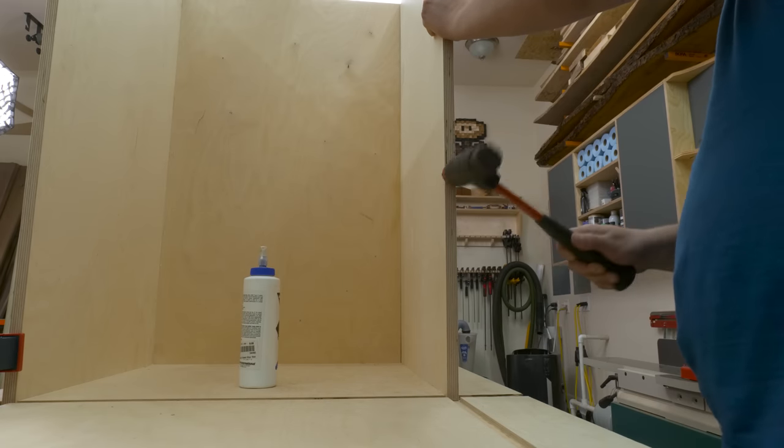With all my hardware holes plunged, I dropped the drawer front onto the case and used some sixteenth-of-an-inch shims to give me equal spacing around my drawer fronts. I drove some screws into those hardware holes to align the drawer fronts on the boxes — a quick and easy way to get drawer fronts attached. Once I had the drawer box removed from the carcass, I drove in two screws from the back side, removed my two alignment screws, and plunged two holes all the way through the box. Then I attached the pull hardware bolts through the back of the holes and slid all the boxes in to check the fit. I took a little bit of time to fill in all the brads with some wood filler and sand everything back to 220. Since everything is already up on the bench, I figured now is as good a time as any to put a little finish on it — it is walnut, so I put a little bit of oil on.